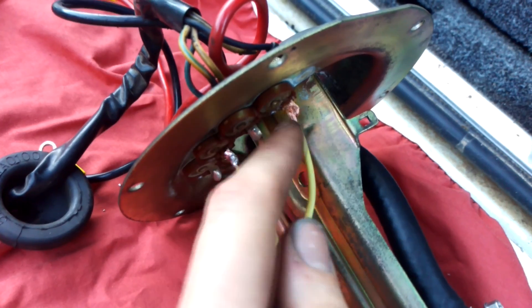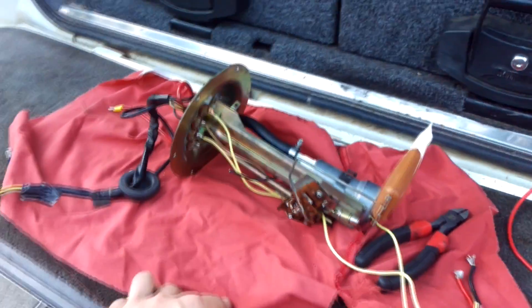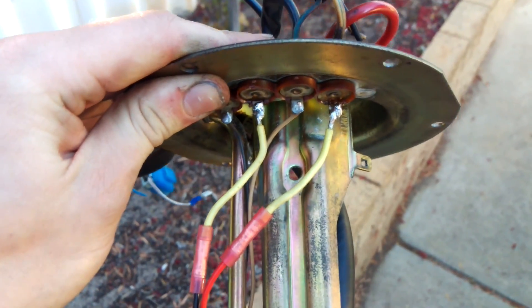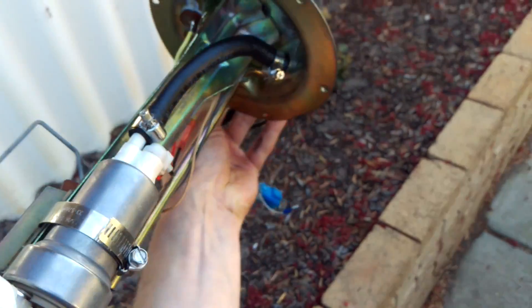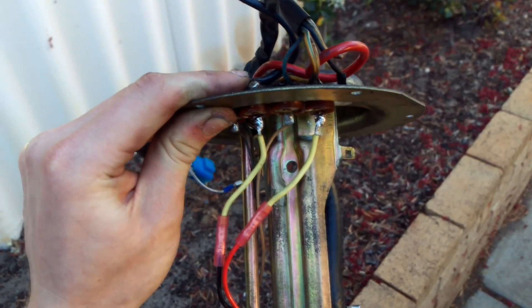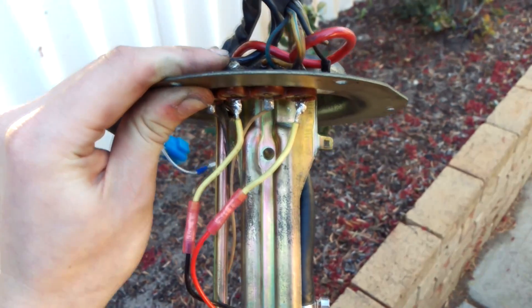Once the pad is clean, there'll be a hole there, so get your wire, loop it through the hole, and then loop it back on itself. Put your soldering iron underneath, heat it up nice and hot, then feed your solder in. It ends up nice and strong. Run new wires off the top to a relay as mentioned previously. Here's a quick snippet of the final soldered connection — it's pretty nice, straight-throughs to the pump. I tested the resistance between the end of the wire and the solder joint and I've got only 0.2 ohms on each, so I think we're good.